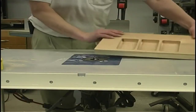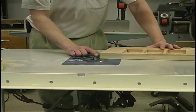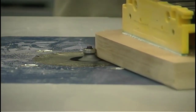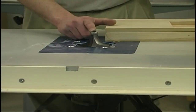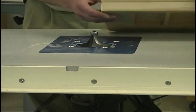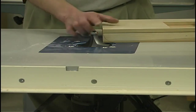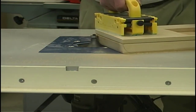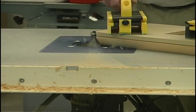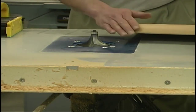With the pockets now machined, we're going to be rounding over the bottom edge of our top panel, starting out with a quarter inch radius round-over bit. Now we're going to switch over to a much larger inch and a quarter radius round-over bit and round over the top surface where the pockets are on our top panel. Because the bearing would be above our workpiece, we need to reattach our template. Because this is such a large radius round-over bit, I'm going to take it in several light passes, and it will probably take a little bit of hand sanding to blend everything together.